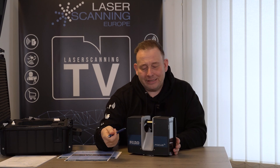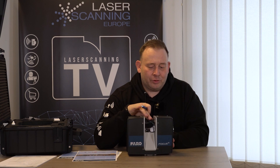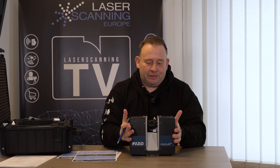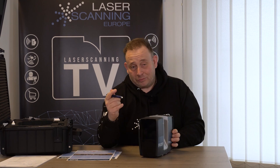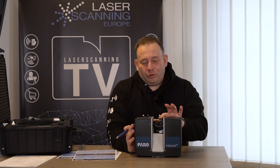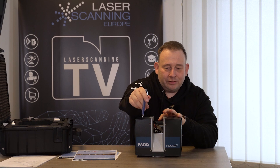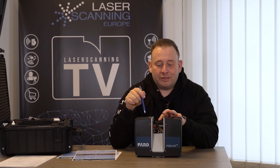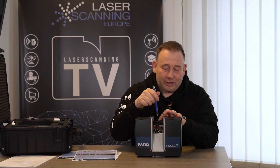In this part here is a laser unit inside. We have a camera inside as well. There's a motor inside that runs this mirror. We have an additional internal motor that can turn the whole system. There is a battery case inside with four and a half hours of battery life, and we have a display on the other side. The laser goes out, hits the mirror, exits, hits a passive reflection object, and comes back to the unit. The unit measures using phase shift to determine the distance to your object.